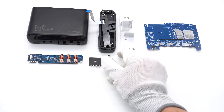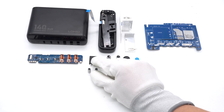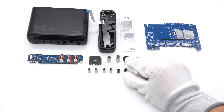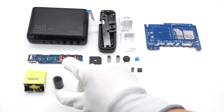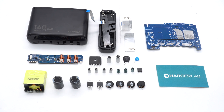Those are all the components of this charger. The detachable power cord allows you to use it on the desktop or carry it out, and the replaceable plugs are helpful when you travel to different countries. It also has a display to check real-time power. ChargerLab found it adopts four buck circuits corresponding to six ports. Most internal components come from lesser-known manufacturers, which keeps the price lower. Still, each USB-C port can output up to 100W. So if you need a cost-effective charger that can charge multiple devices at high power, you can consider it. That's all for today's video — please drop a like, leave your comments, and subscribe. See you next time!